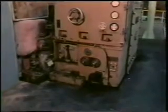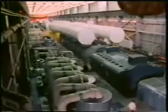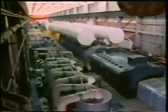See how this great steam pipe is mounted on heavy metal springs. Here's the front end of one of the high-pressure turbines. The whole long chain of machinery forming the turbo-generator expands when in use and contracts on cooling. It's fixed in the middle, but can slide over greased metal plates at the ends. The machinery expands in this direction when it gets hot and can slide on this heavy metal plate. You can see from the scale on the base plate that movement has taken place. Without precautions to allow for movement caused by expansion and vibration, this vast plant would quickly wreck itself.